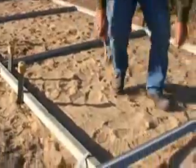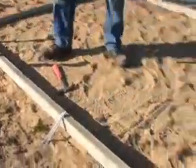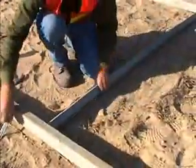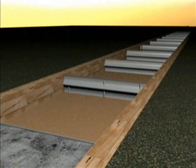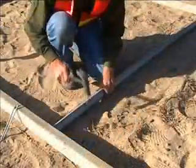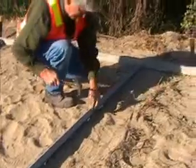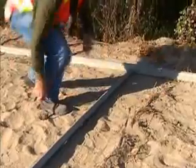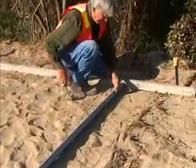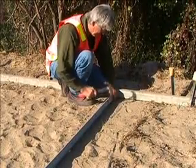Firstly, to define the distance between the lengths of TripStop, the length itself is generally used as a spacing guide. Ideally, concrete is laid in square sections. Now the TripStop is in position, use the three galvanised steel pins which are driven through pre-drilled holes into the ground. The TripStop should be pinned in the trench upright so that it is at 90 degrees offset to the finished surface, and must not be allowed to deviate by more than 5 degrees either way.